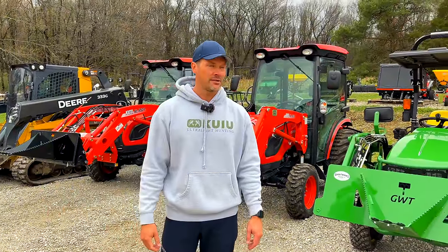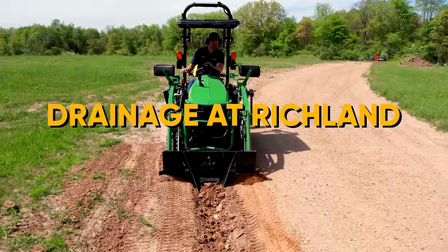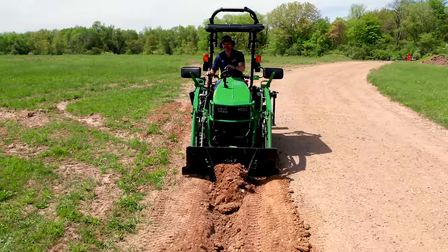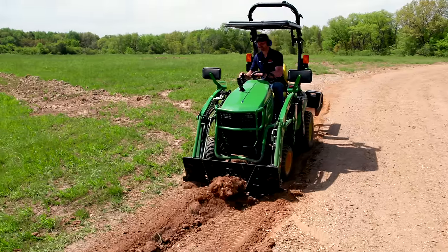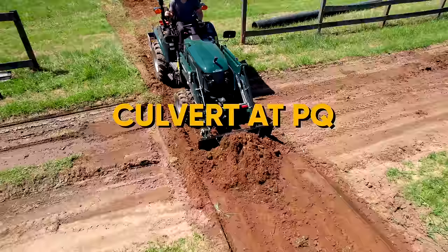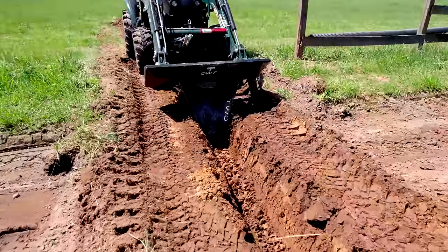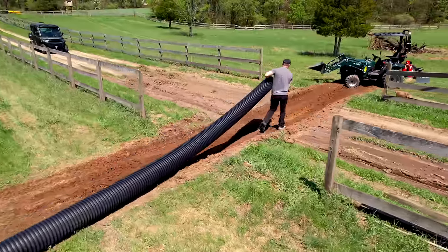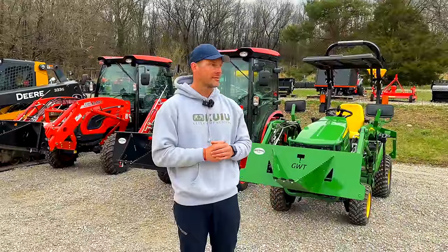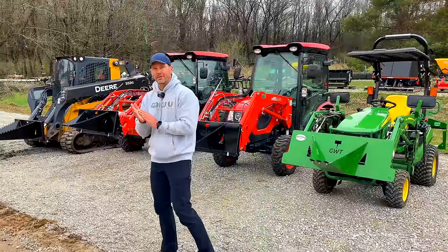You can also trench with these. We dug drainage swales on each side of the driveway and buried a culvert going across the drive. That culvert is now under about 18 inches of dirt and stone. We had a Facebook ad showing it when I'd just set the pipe in before it was graded out, and folks were saying it would get crushed — but that culvert has had countless dump trucks over it and it's perfectly solid. Funny how people comment about things.